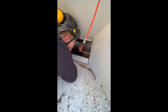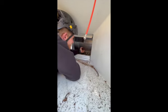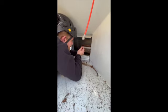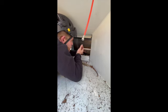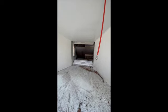So what you're going to want to do is put that tool on the edge of that anvil like that, and your clearance should just be clearing that anvil. If it's tighter than that, you're just going to get a smaller chip out of it. If it's wider, you're just putting more wear and tear on the drum than it needs. I'll climb out of the way so you guys can see what I'm talking about. You can see how that knife is just clearing that anvil. You guys get the gist of it?